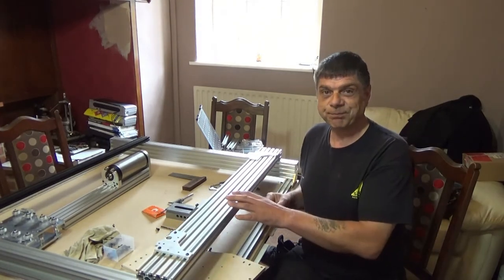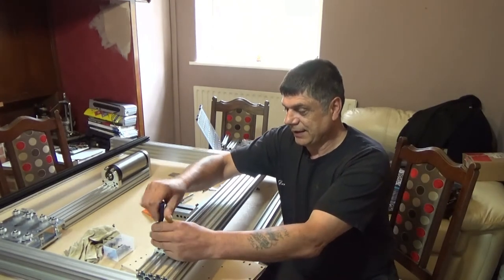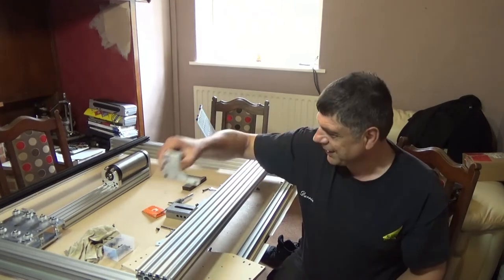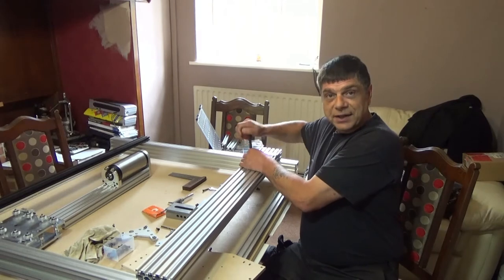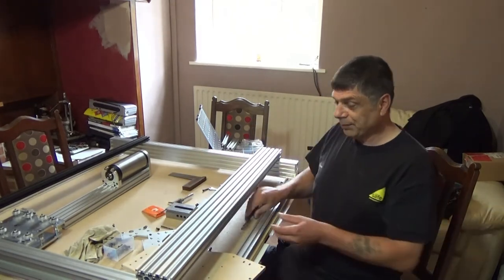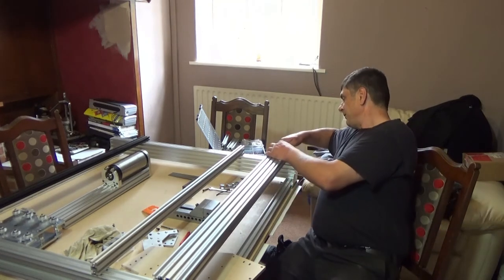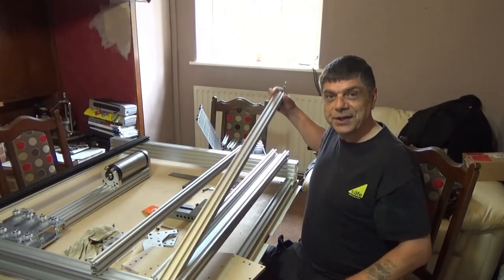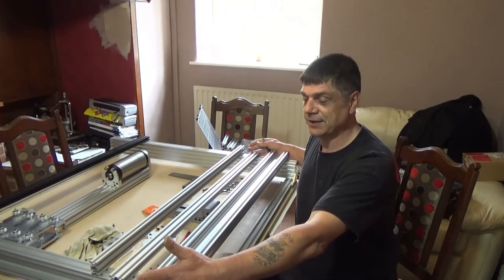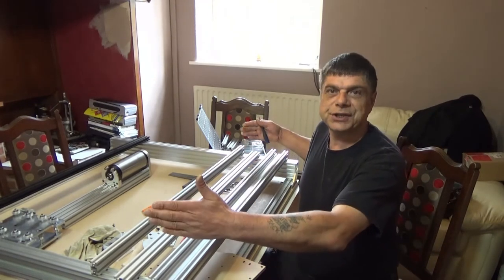Now, using some brackets, in fact I can take these off now because I've trimmed it up, using these, I won't say leftover, but sort of prototype corner brackets that I didn't like for some reason, I managed to strap them to the extrusions, which kept them exactly how I wanted them. Now we've got one extrusion sat at the back, and you can fit a 20x40 in the centre of the C-beam. So by running the router across the end of these, all three of them are exactly the same length,